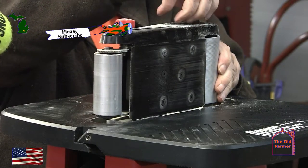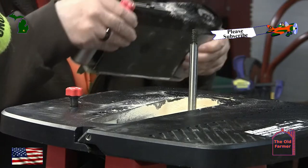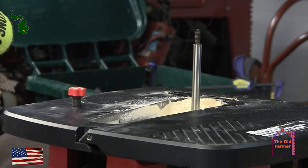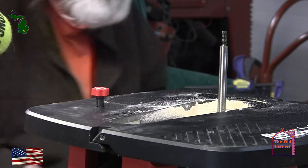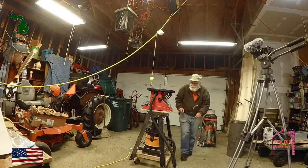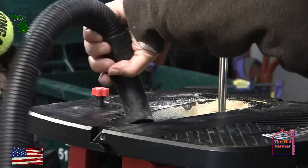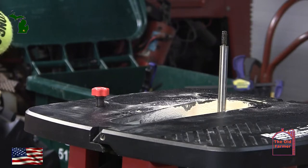In this case, get a squeezy tool such as pliers or channel locks, and wrap the head of the bolt in a cloth such as a shop towel or a rag. This will protect the head from being scratched up. Then firmly and confidently squeeze the head wrapped in the cloth with your squeezy tool — do so firmly without trying to squeeze it to death. Turn slowly in a counterclockwise direction. If the wrench starts slipping, apply a bit more pressure for a tighter grip. Chances are good that a quarter to a half turn will loosen the bolt, and then you can unthread it by hand.